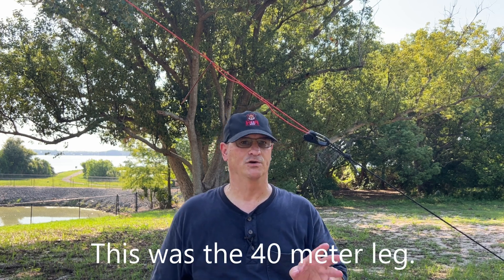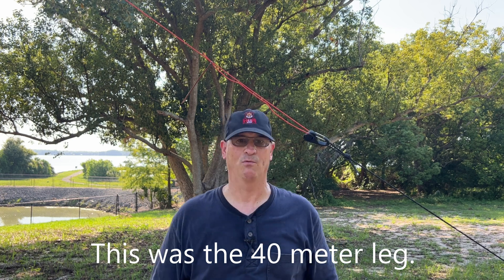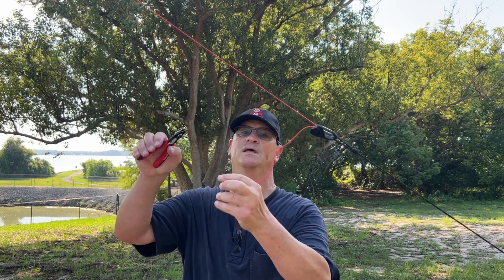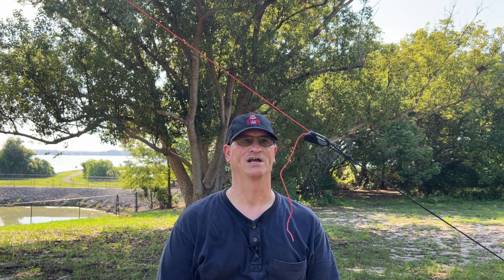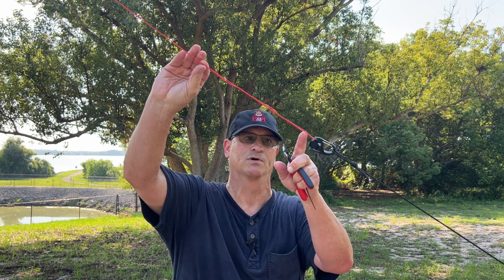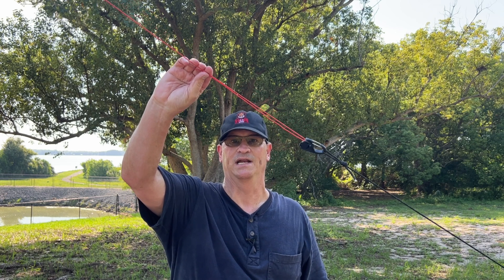You're seeing the after, once I finally figured out what was going on. I couldn't get better than 1.75 to 1. I kept shortening and shortening and shortening, and I wasn't getting any better — I was getting worse. Then I walked up to my wire and I realized that as I was shortening it, I was hanging the extra length — I was making my antenna longer. Once I realized the mistake I was making, I just folded it back on itself and put a zip tie on it. Electrically, this is how long the antenna is — it doesn't take into account this extra leg once you fold it back on itself. And then we got that great reading at 1.2 to 1.